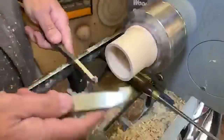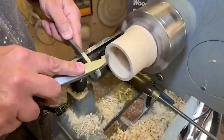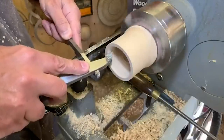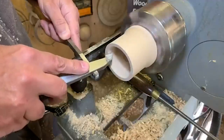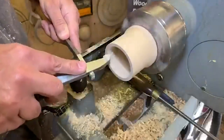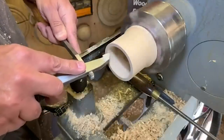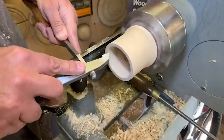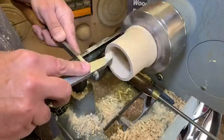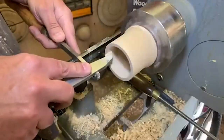So there we are. There's my armrest. And all we're going to do, a nice, gentle start. And I'm pushing inwards. I'm on the corner first. I'm not using the tip, I'm using the main section of that thread chaser. And as the thread starts, I'm just going to start bringing the tool around to lengthen the thread. Once you've got the thread started, it hooks in and guides itself almost.